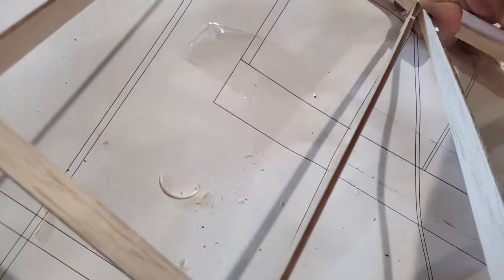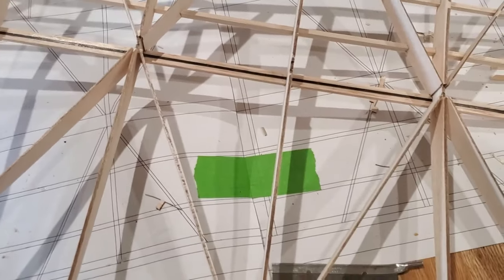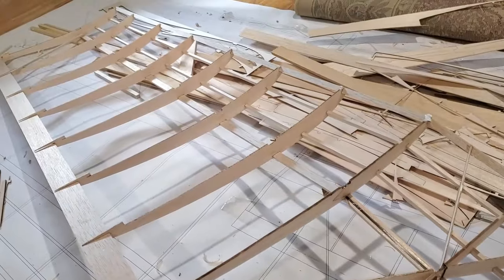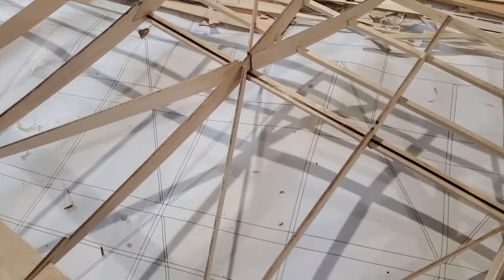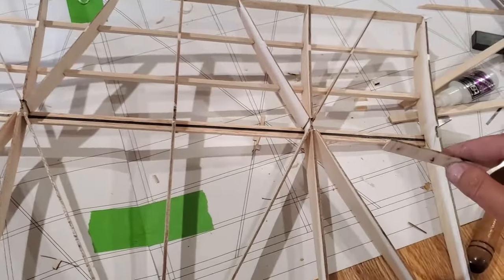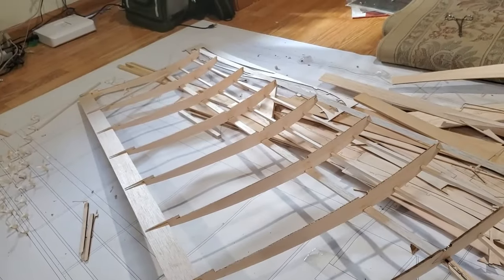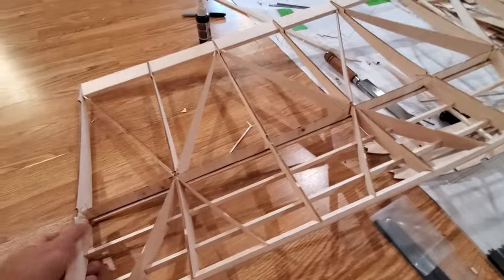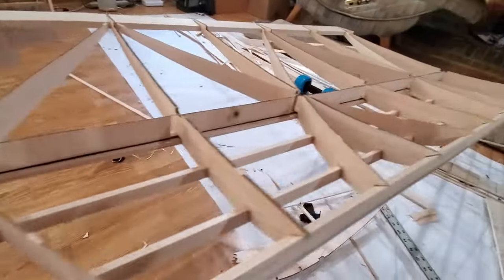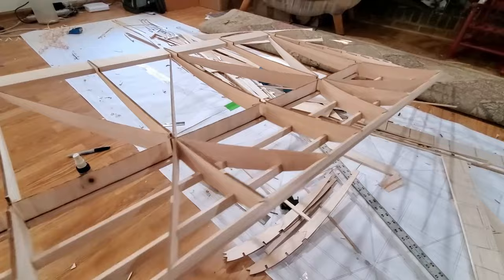I keep gluing the plans to the plane. Once it's all up, I laid some carbon in here. For the center panels, we'll lay much thicker carbon in — but this is just for the outer section. I have all the shear webs in now. You can see them here. I'm going to lay carbon on top of this and then put the lower spar on it. Out here I just did partial ones. These are all two pieces to fit across there.